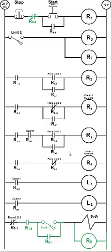Now, as soon as it starts to retract, that becomes open. And as soon as that becomes open, that de-energizes. So this goes back to its normal state. And this counts one more count of the cylinder going out and starting to come back. It's the done bit. So that event of the cylinder going out for the second time is done. So what happens here is this actually just shuts everything down because we're done. We don't want it to go out anymore.